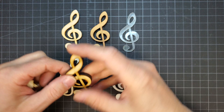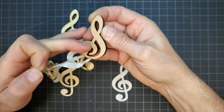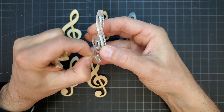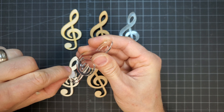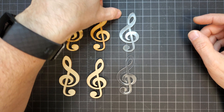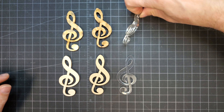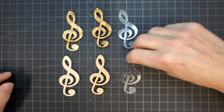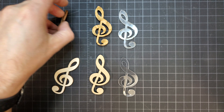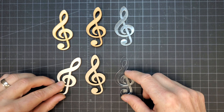With the masks on, there wasn't a huge difference in the look between the wood pieces. It was obvious, though, how bad the unmasked acrylic piece looked. Once all the mask pieces were peeled, the differences became more apparent. You can also see how bad the burning gets on the back of the pieces — so even if you're okay with the light burning on the top surface, you might want to at least mask the back side of your material if it will be visible.